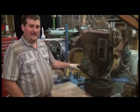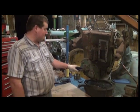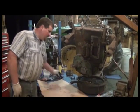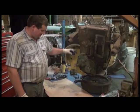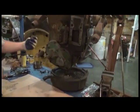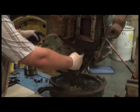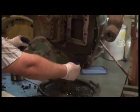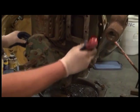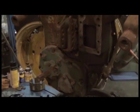Now, to remove the power shaft clutch, you don't need to do anything special. It doesn't matter if it's engaged or disengaged. I recommend doing it disengaged personally. Remove all the bolts around the housing like this. And I think there's two studs in this case, and then several bolts. We're lucky enough on the 30 series that John Deere put tabs on each side to use a pry bar to help break the seal between the gasket and the cover.